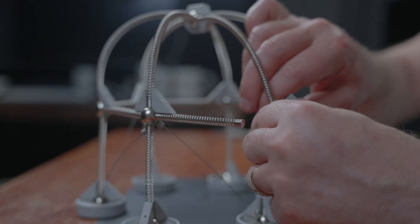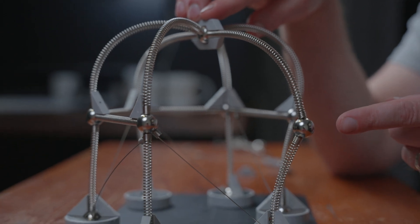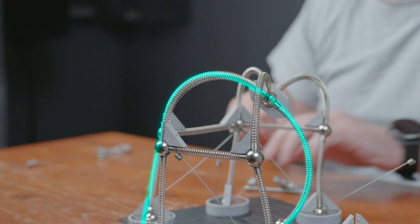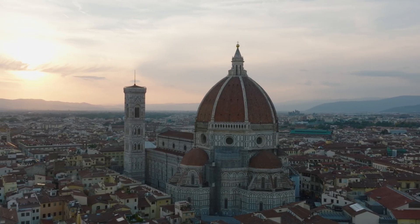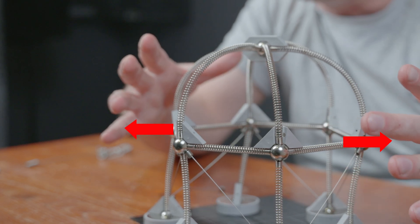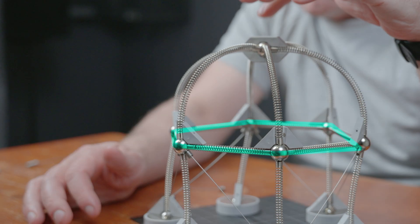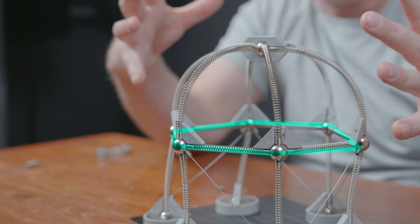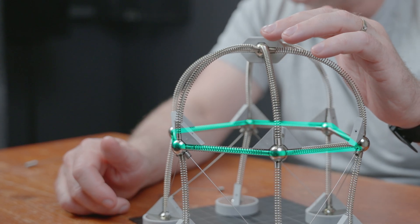So if we break the ring in one section and press on it, we can see the force going out causing a catastrophic collapse under a very light touch. Brunelleschi's dome is one of the most famous structures that showed the true genius of the engineers back in the day – they were both architects and engineers making these amazing structures, dealing with lateral forces that need to be resisted. Belt trusses around the middle tie everything together to stop those outward forces, so as they try to move out it doesn't distort – it just pushes out and is resisted by the counterbalance of forces in the other direction.